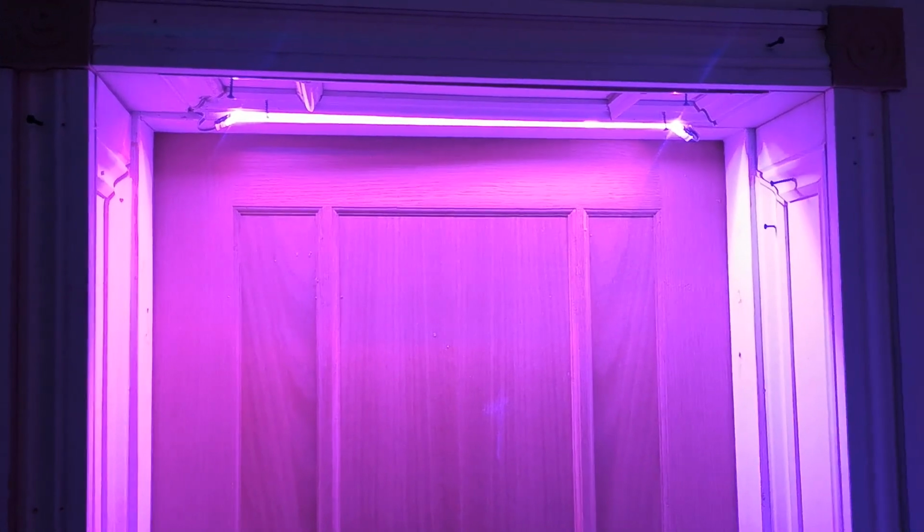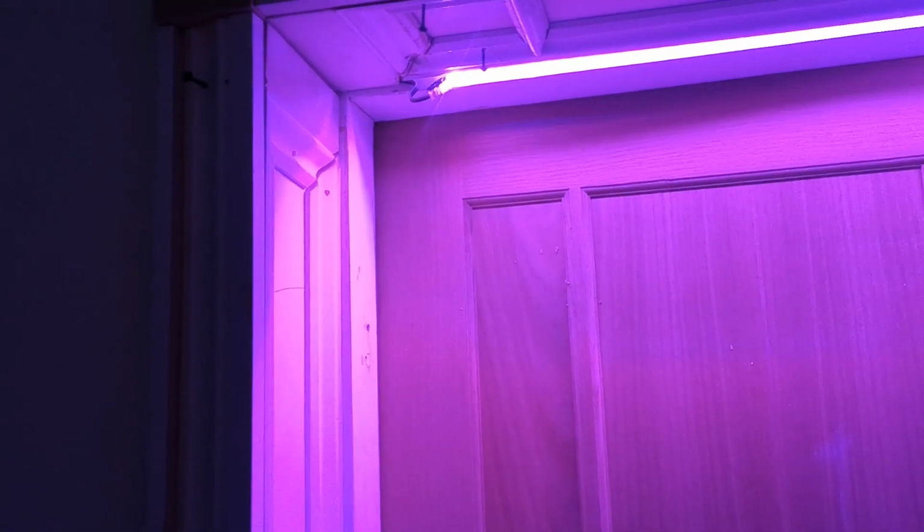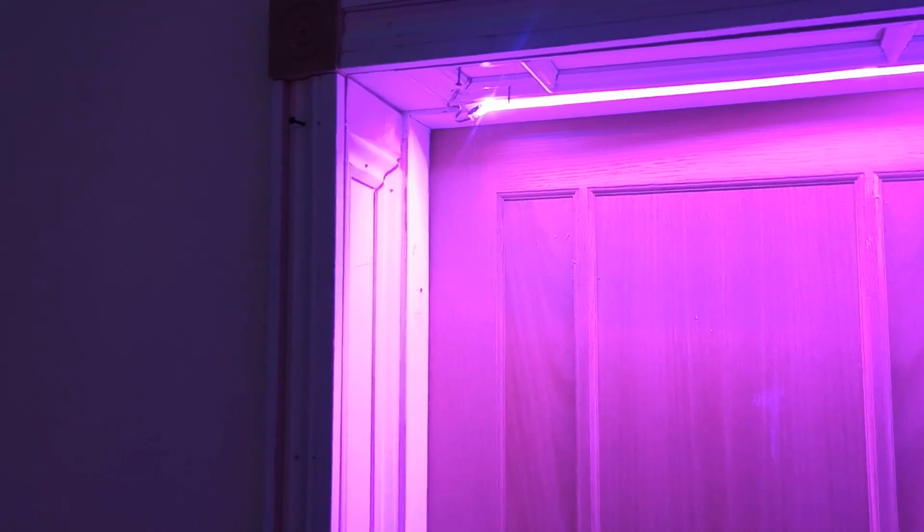Okay, so it's obviously the RGBW strip, but at the moment the infrared isn't working too well. So what I need to do is buy a radio frequency, so an RF remote control and controller, to wire in just before the driver, so that I can access the colour changing driver from anywhere in the house, as opposed to just pointing it at the infrared, the small black infrared receiver. So with the radio frequency you can change the colour from anywhere in the house, but with the infrared you have to point it directly at it, just like you would with your remote control for your television.